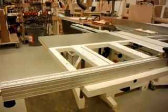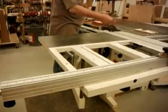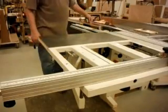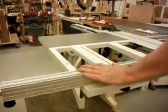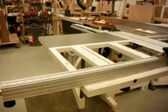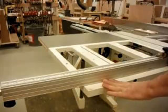So now, if I grab my tape measure, I have a maximum of about 38 inches to the blade, which is enough for most applications. And if I want to cross cut a 4-foot sheet, then I'll move this fence up to here, and I still get a 4-foot. If I need 5 foot, then I take that off and use it pushing against the fence.